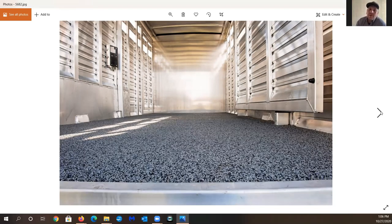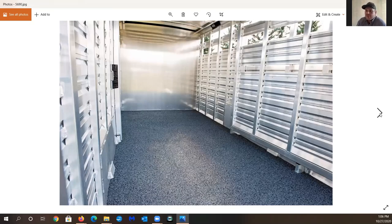Yeah, one of our dealers actually came up with what we call Stomp Guard. One of the problems that we run into with the floors is if you have a horse that continually paws, they'll damage the floor. So we'll go in there and fix the paw hole, and then we'll take our super rubber filler, which is the rubber filler that we use in vet clinics and such, and we'll do underneath the front feet, and they can't damage it or anything like that. So it really helps with that.